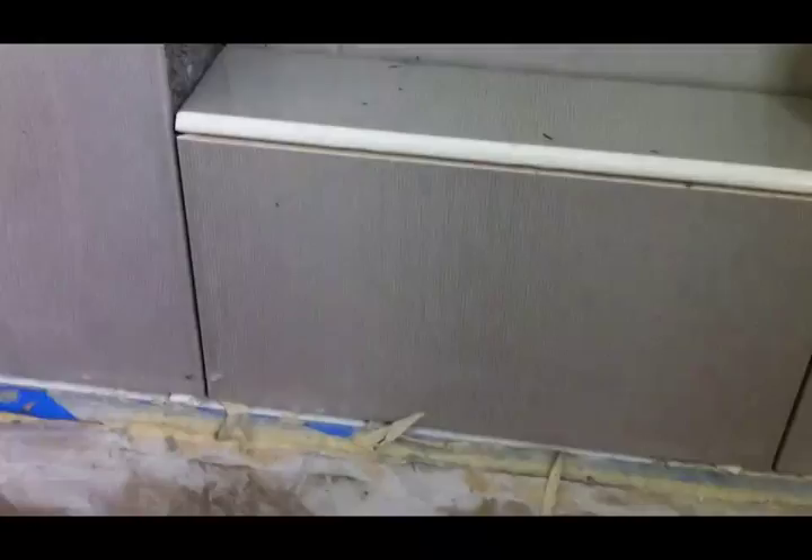I loaded up the back of the piece of tile the same way and put it in there. Make sure your designs are the same as your outside walls — don't put your tile in there not lining up. Make sure the space around and inside the soap box is all the same — tape measure it. You want that joint when the surface bullnose is all the same. The soap box is all done and it sure looks sweet — all the joints are uniform and even. That's critical because everybody looks at it.